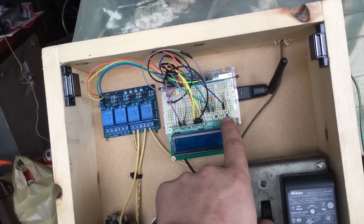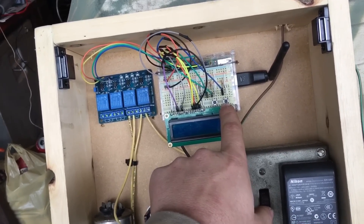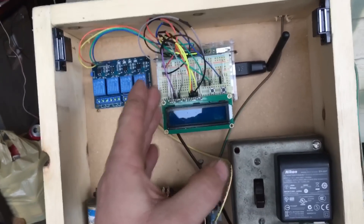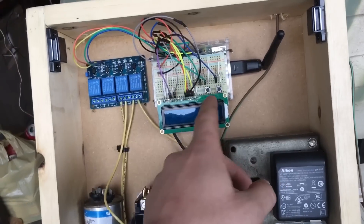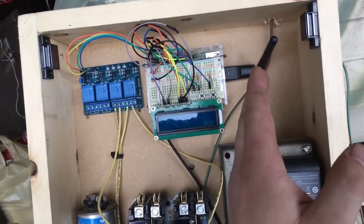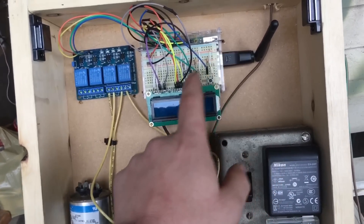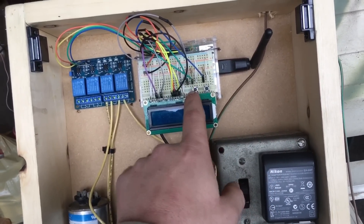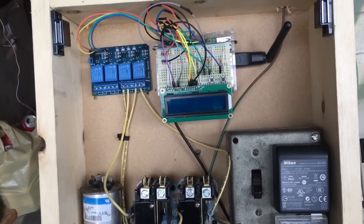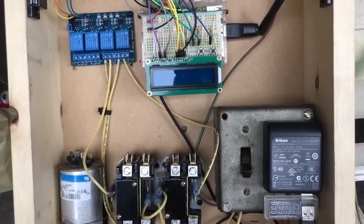The home button is used in case we lose power and we go to start up and the actuator is in between proxies — not forward and not back. We can press this button and it will home to a retracting position, then wait for the next cycle. This button will be replaced with our photo eye for product present. When cans are present it'll start crushing cans, and the LCD will display 'waiting for cans' or 'crushing cans.'